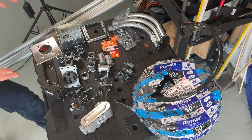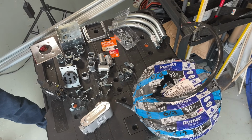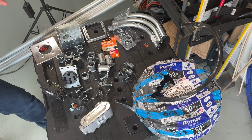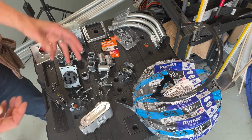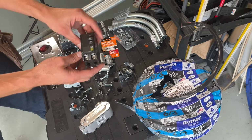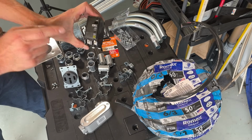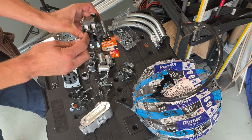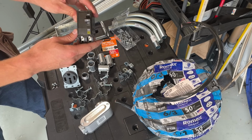Parts. Now if you're a DIYer, this might look a little bit intimidating. You might not have worked with most of these parts before, but we want to share everything we've got here so that you can be the most successful and maybe keep this project down to 2 trips or less. Starting sequentially at the electrical panel, we have a 2-pole 50 amp breaker. Don't let the half-size handle fool you in this case, because see, there are 2 terminals and 2 connection points to the bus. This is most definitely a 220 volt breaker.